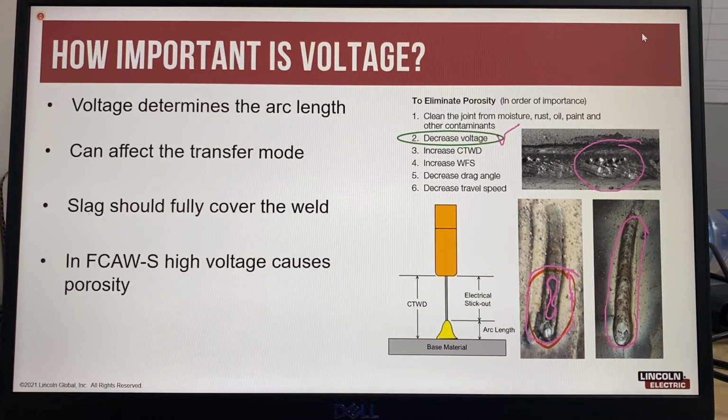However, the higher voltage can produce porosity in the weld metal, which is a common problem when welders change process but are not trained. So the best practice principles: ensure welders are correctly trained for the processes they are using. Ensure connections are tight and welding cables are the correct size to reduce heat buildup, which will affect arc voltage.